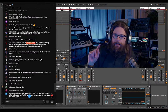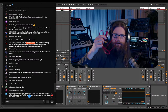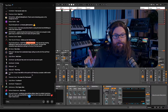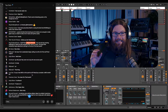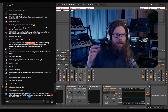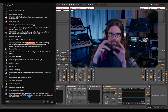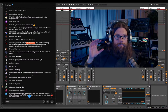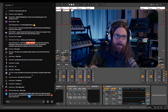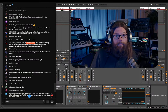Do you miss MIDI? Well, there is CV and gate in that one, and it's possible to plug in these cables. I successfully controlled it with an external sequencer. The only thing that does not work is gate, because it doesn't have gate. It has something called S-trig. I need a special cable for that, because they didn't build in a standard one, but a very obscure connector that I don't have. I will need to get this connector and solder it to one of these cables. Then I can use it with a sequencer. That will be amazing, and I'm very much looking forward to it.